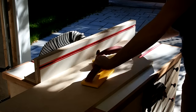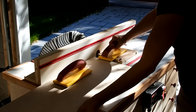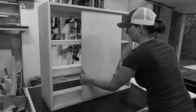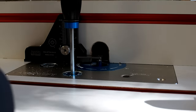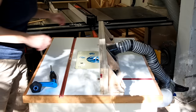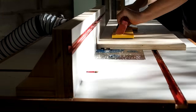It helps to trail with a scrap piece of plywood to prevent tear-out at the back of the panel — just make sure to hold it down until the router comes to a full stop. Now the secret to sliding doors is that the groove at the top of the cabinet has to be deeper so you can pop the doors in. So for the top panel I raised the bit once again and made the dado a little deeper. I could then move the fence back a bit and repeat the process for the second set of dados for the sliding doors.